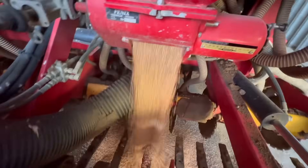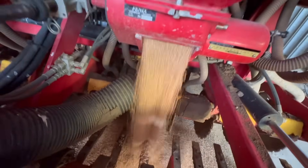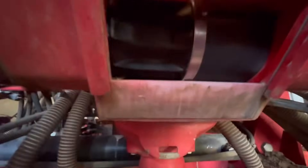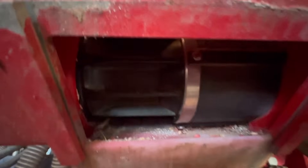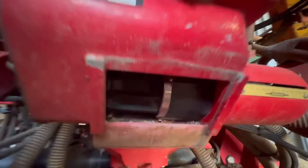Just emptying it out — that's it, empty. See it's got its barrel in there — that's what I turned earlier. It turns to let the seed out. And then if you want to adjust how much you put on, you turn this handle and it moves this bit in and out to let more into the barrel or less into the barrel.